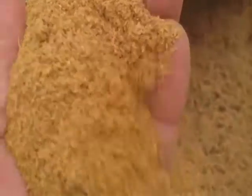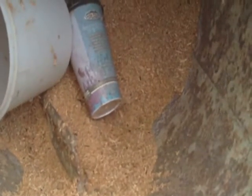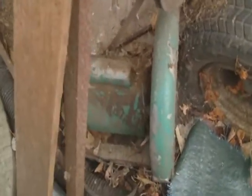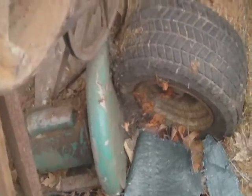And the distiller's grain is here — that's what it looks like, just looks like cornmeal pretty much. We tried several different recipes until we got it down. We mixed a ratio of 60% wood to 40% distiller's grain, and I think we could actually get it down to 75% wood and 25% corn. This was powered by a motor here that also has a blower on it. The motor would run the cement mixer, and I'd do five or so gallons at a time.